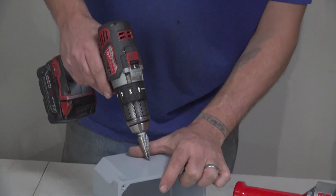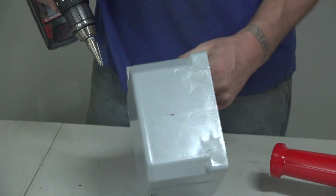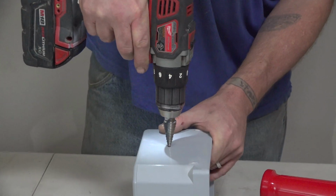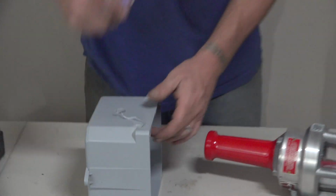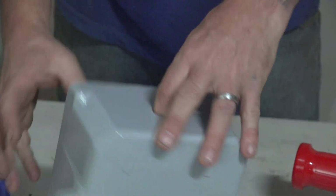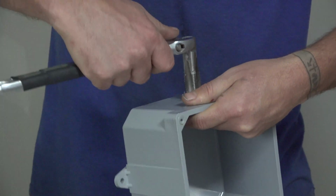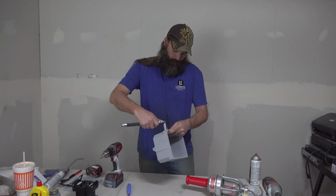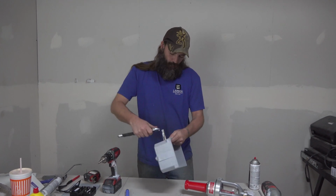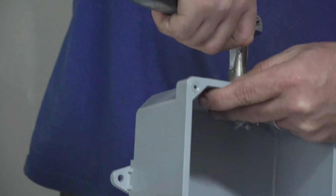Here you'll take your unibit. Take your reamer, clean off any excess, make a nice smooth surface. Then you will take your tap. I run my tap about 1/3 of the way down. That way you are still actually tapping when you put your CGB in.